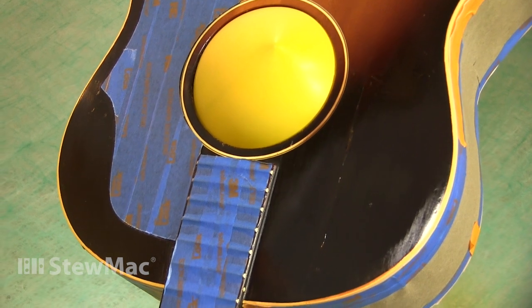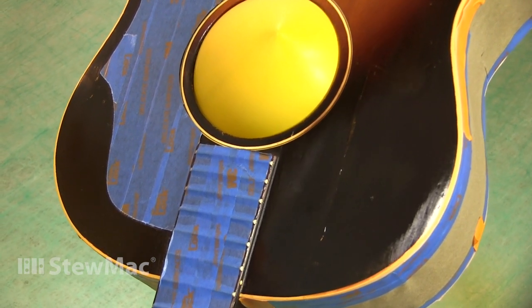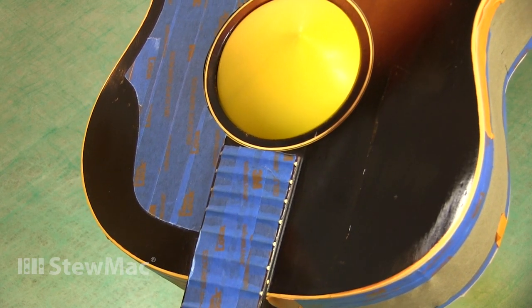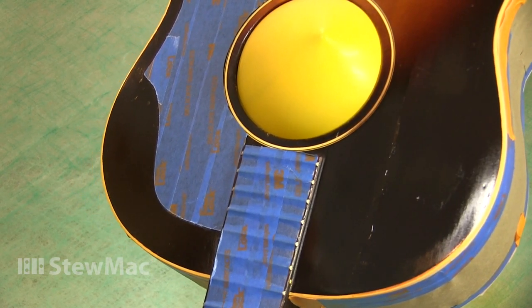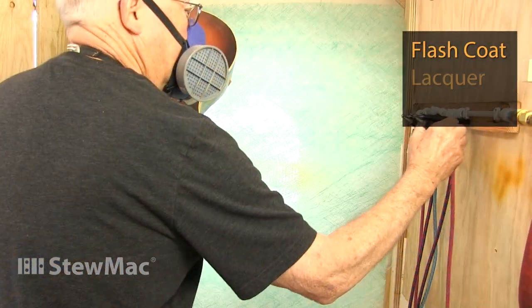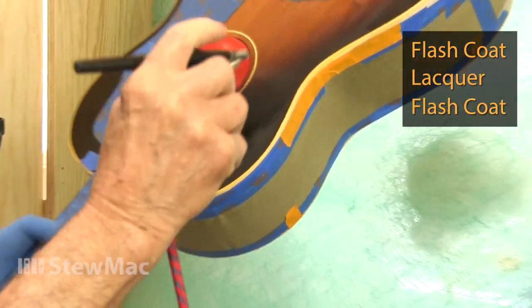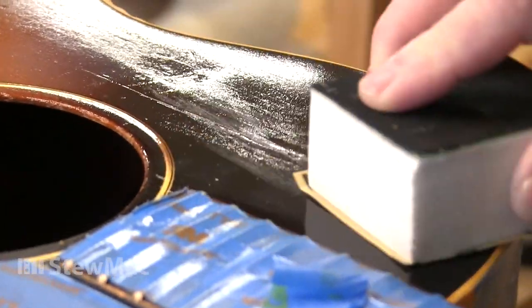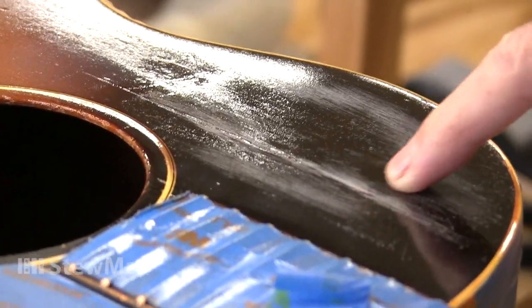Here's what it looks like about three minutes after we just sprayed it — if the camera can get that. It's shiny, but it looks thin because the solvents have gone away now and left a thin layer of lacquer. We're trying to fill lacquer in around that crater of repair that I did. I'm going to wait about an hour and a half and repeat this operation at least once more, and then sand. It's hitting that high spot.